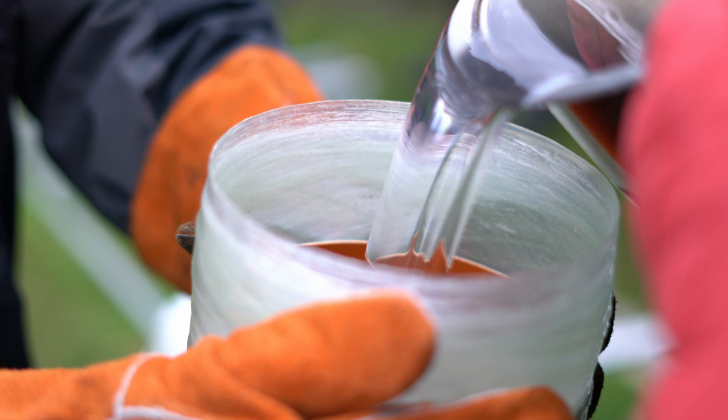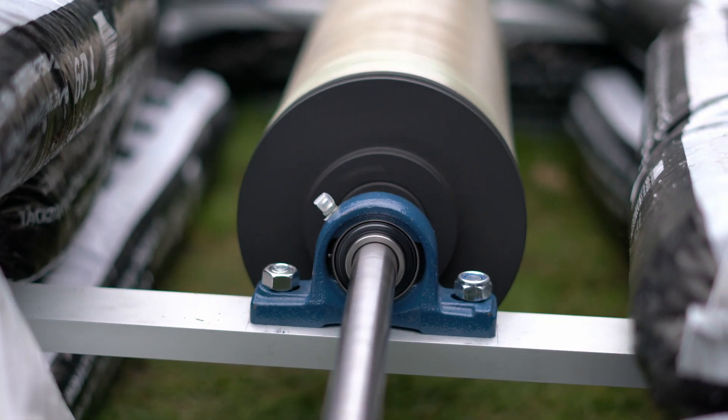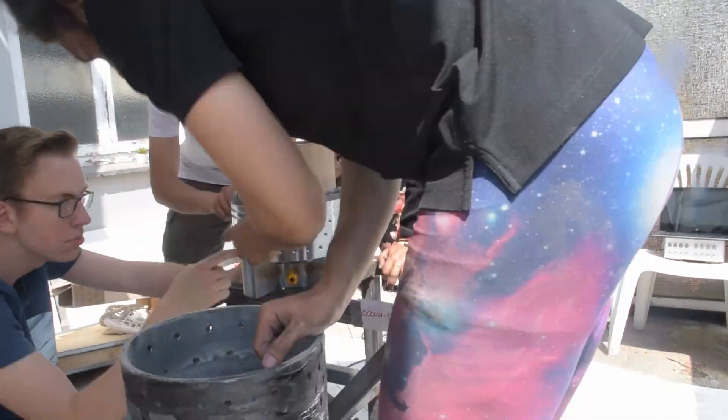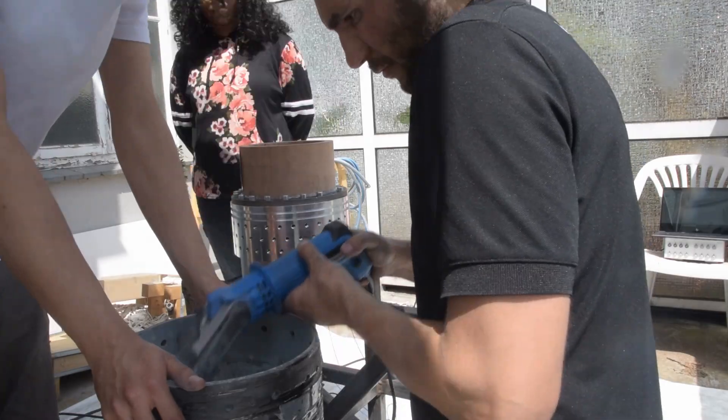The outside of our grain is spun inside a PVC tube, but a 160mm PVC tube can't contain the 30 to 40 bar of pressure we expect — PVC tubes usually only get up to about 15 or 20 bar. So we designed a special device called the spacer ring, which we insert into the casing. This ring has an inner diameter of 160mm but has little petals that take the force from the PVC tube and transmit it to the casing. We have 13 of these rings placed into the casing, covering the entire surface of the PVC so all structural loading goes through the rings to the combustion chamber casing.